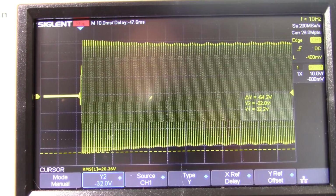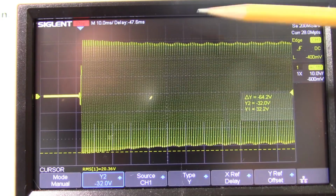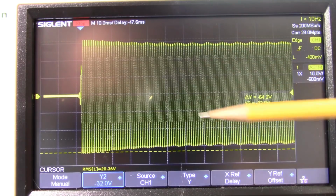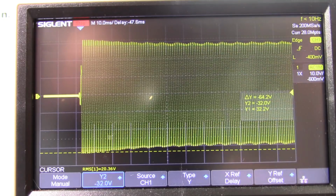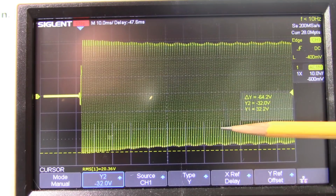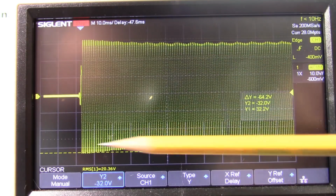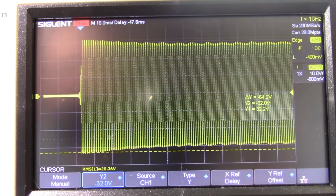One thing I should mention is, if you run these tests, make sure that your test signal and the mains frequency are not harmonically related. Because if you're testing at 30 hertz or 60 hertz or something like that, and your line frequency is 60 hertz, well, you could get inadequate readings for your continuous and dynamic test, because the waveform could be in step with a peak. So you might be seeing more power than you can actually get, and that would be an invalid measurement. So when the frequencies are not harmonically related, or at least your test frequency is many times higher, you can see the peaks and valleys properly and get valid data.